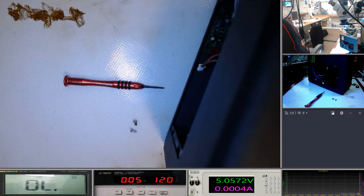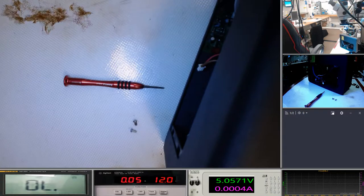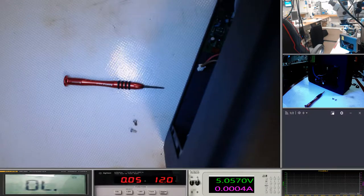With chip damage, that's the only thing that can happen. You'll be using it, and for instance, if the capacitor fails on one of these on the power rails, it will just turn off, and then when you try and plug it in, there'll be absolutely no signs of life. It can just seem like a software problem. You can even have it where the phone will boot to the boot screen, but won't go any further in some Apple products. That again is actually hardware, but you've got three or four sections in the phone that control it, so it can seem like one thing when really it's leading you in the wrong direction.